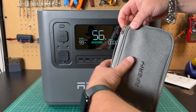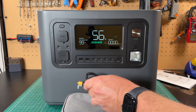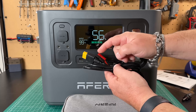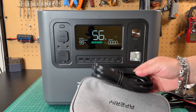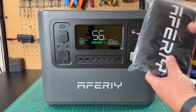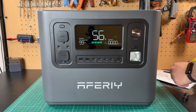It's going to come with this nice zipper pouch for storing your cables. Here we have the XT90 cable, which is going to be for your solar charging. It comes with these types of connectors, but I cut them off and put Anderson power poles on there so you can connect your solar panels. It's also going to come with your AC charging cable — you can just pack everything in this bag for easy storage. You'll also get this cover that goes over the power station when you're storing it to keep it nice and clean.